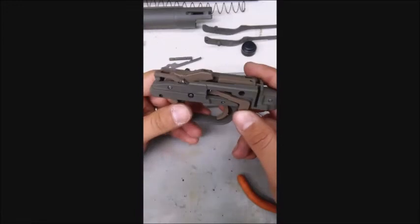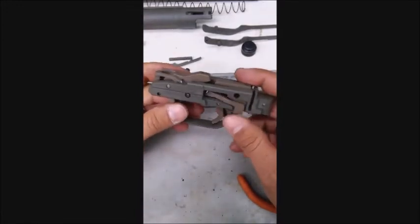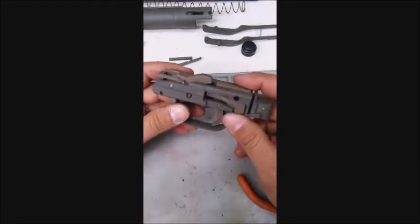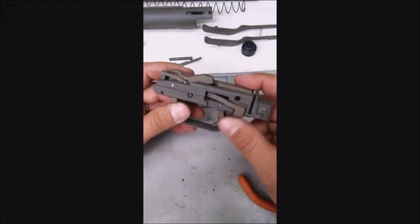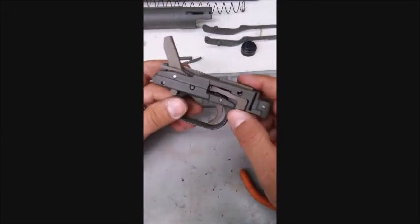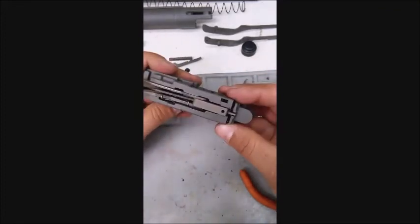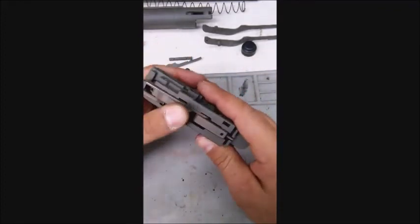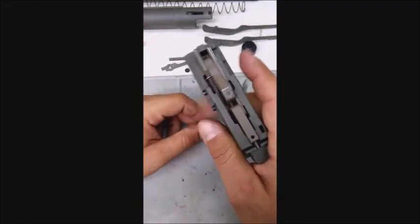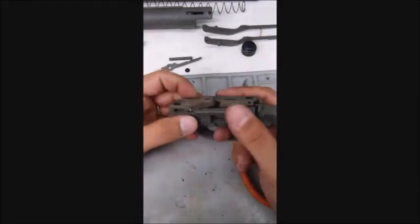So now that the hammer's back, we want to release our bolt. Take it out of battery. Remove the shell that's in the gun. We should be able to push this up and have it return to its position. When we fire it, that thing should retract, and it should have spring pressure just like that. That's a trigger pack. Pretty simple. It looks simple, but it's not.